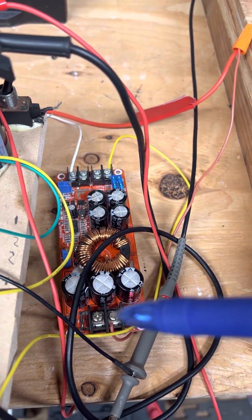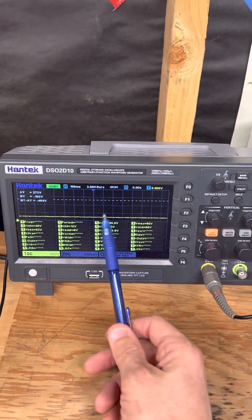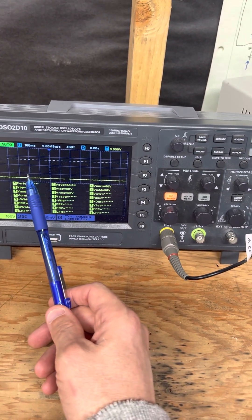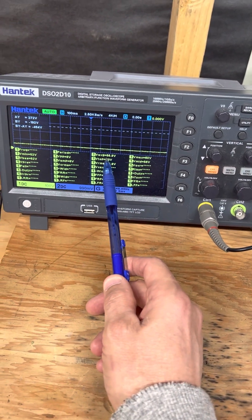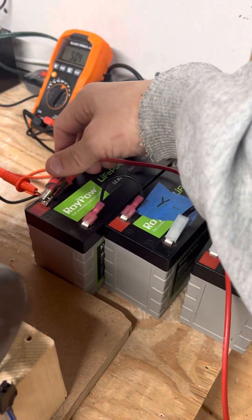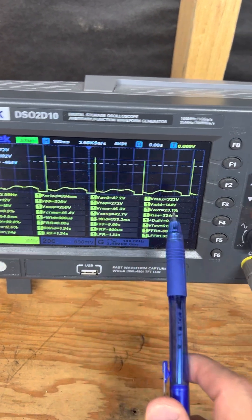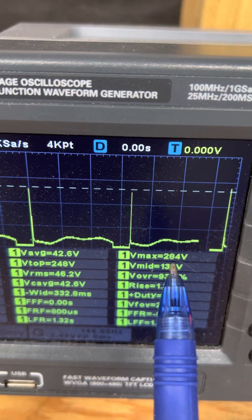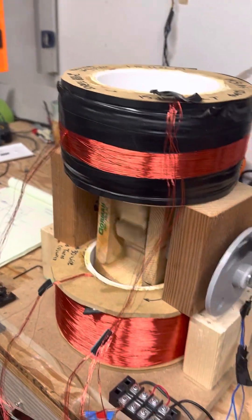Here's the scope. Right now this is the reading on the positive going back to the battery — you can see it's averaging 56 volts, just steady. Let me unhook the charge batteries — the three that are receiving the spike — and voila, you see these spikes every time the switch opens. You can see here the max is 360, around 350 volts. So it's pretty high every time that field coil collapses. These are big coils — each one is 15 pounds of copper.